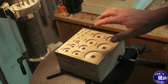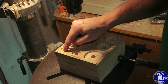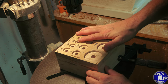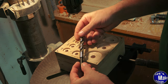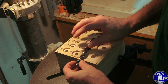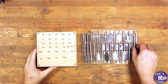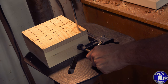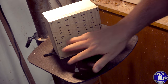A trick I found for getting each hole at relatively the same height is: when you put a new Forstner bit in for the smaller hole, go to the last hole, set your depth on the drill press, and then move over to the next hole. That helped me a lot and made it go faster. Once you get below 5/8ths, Forstner bits are pretty much useless — they clog, they're just junk. So from here I'll be using my larger brad point bits to drill out. I don't want to go all the way through, and I'll run it up and down a little to make the hole a little bit wider so it's easier to slide in. To do the spade bits I'll do the exact same thing — I want them to stick out so they're easy to pull out, and I do want to make sure they go all the way through the back.